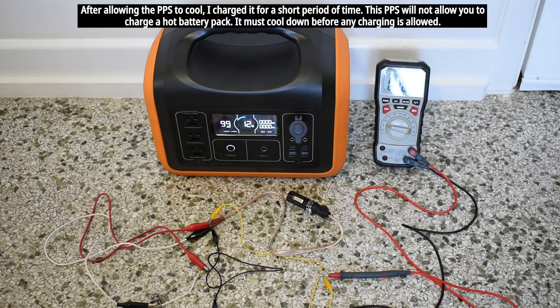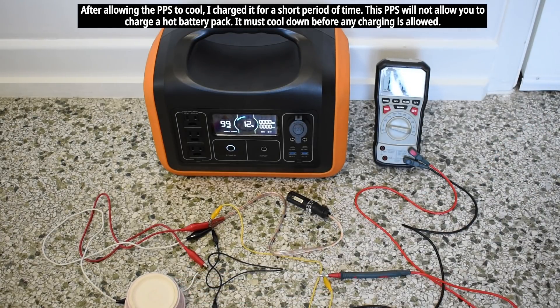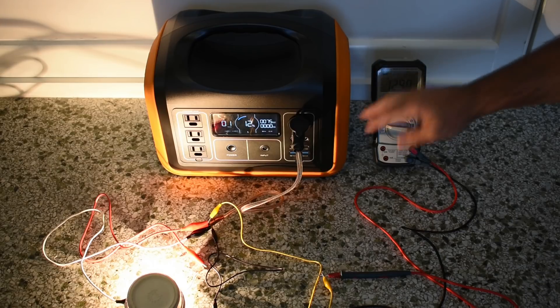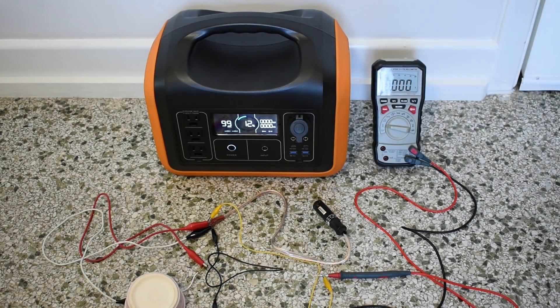The battery is now at 12%. I have a halogen lamp — I'll cover it a bit so it doesn't blind the camera — and I'll plug it in to show the voltage under load: 12.9 volts. So there is regulation on this receptacle even when the battery pack is drained all the way down. This unit tested extremely well compared to the other ones I've checked in the past. I hope you enjoyed this video — if you did, be sure to rate thumbs up, share, and check out my extensive video playlist. Thanks for watching.